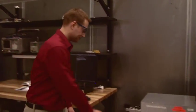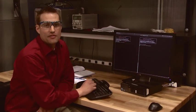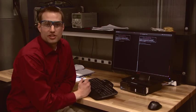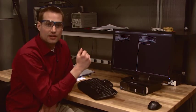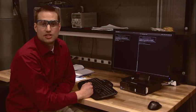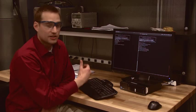Let's start an SAE DC charging session. This shows two terminal windows — on the left is the supply equipment communication controller terminal, and on the right is the electric vehicle communication controller terminal. I've set up the communication controllers in debug mode so I can step through each individual process and message. The first process is plugging in the inlet and then going into what's called the SECC discovery process. We find the server, the EVCC connects to the server, and now we can start the first actual message in the initialization phase.